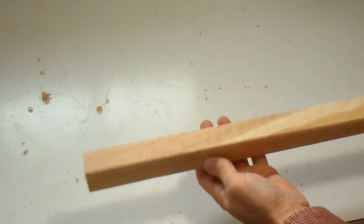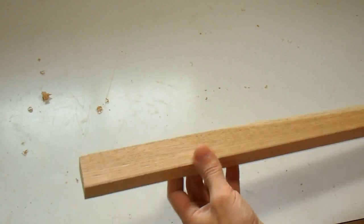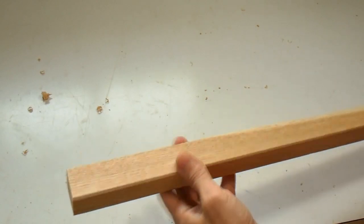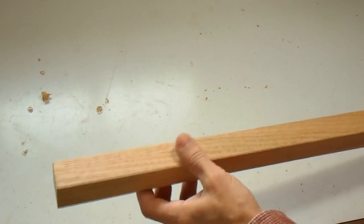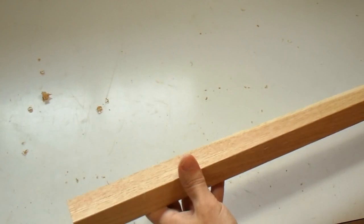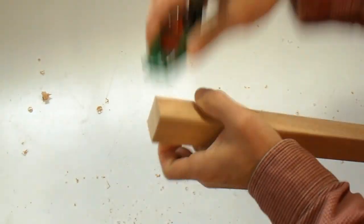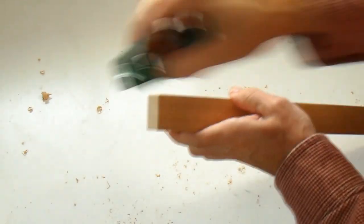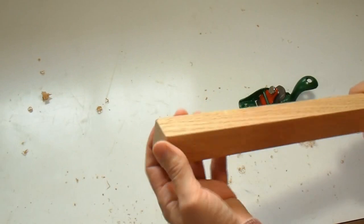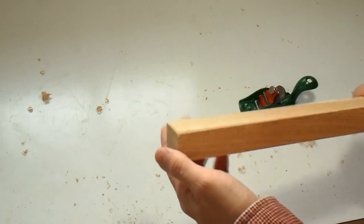It's a great little plane for just rounding or beveling the edges of pieces of stock. The square edges on a piece of wood after cutting or planing are actually quite sharp, and before I can turn this into a piece that's nice to handle, those need to be rounded somehow. I could round those with sandpaper or with a router, but the quickest way is just to use a little hand plane like this. Take a few passes at different angles and that puts a nice little round on it — you can hardly see it, but it really feels different. I can even use it to handle the edges on the end, and the corners too. If I want those to be a little bit rounder I'll then sand it, but it's easier to remove the bulk of the material with a plane because I don't like sanding — it's dusty and it's work.